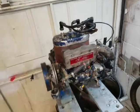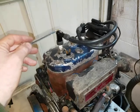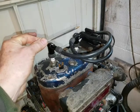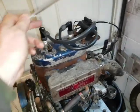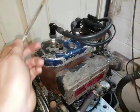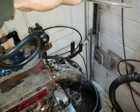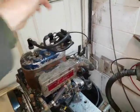So that's an issue, because it means that on a lot of boats designed for a Vire or a small inboard, this HT cap is going to end up very close to the cockpit floor level, which could be dripping wet, and then short out the HT by dripping down here, especially if these get cracked or abused or aren't fully waterproof. I've seen this before. Same with the HT lead, very close to the condensation that might form on top of the roof. If you've got wet bilges, it's going to condensate on the underside of the plastic floor, and then it will drip down on the top of these places.